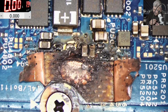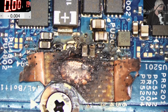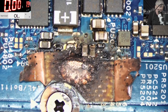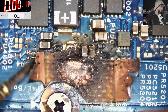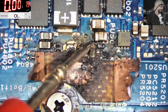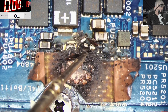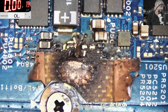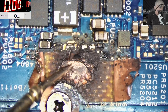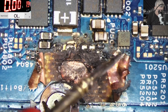Let me check with the multimeter. So with the multimeter, the main power rail is shorted. This one is shorted. So we can reroute this trace from the MOSFET — we can definitely do it. And this trace — this trace is good.